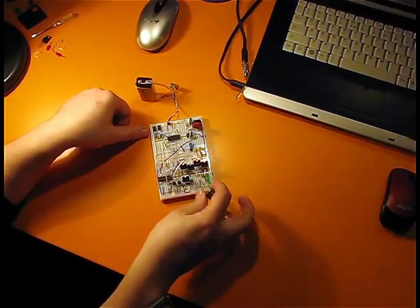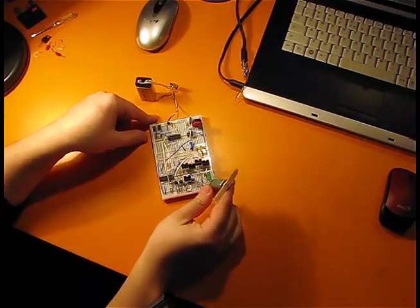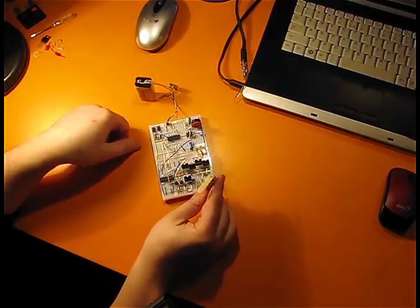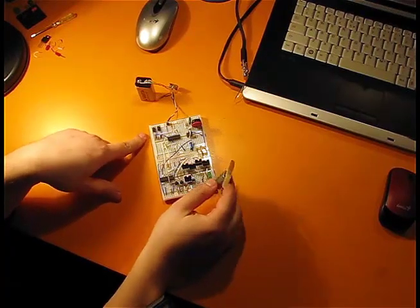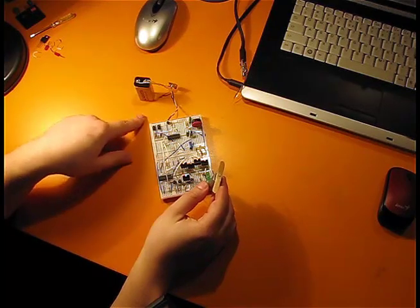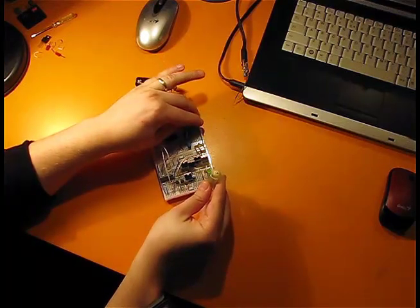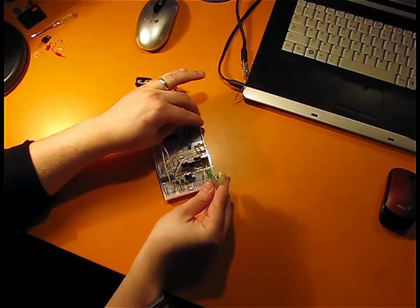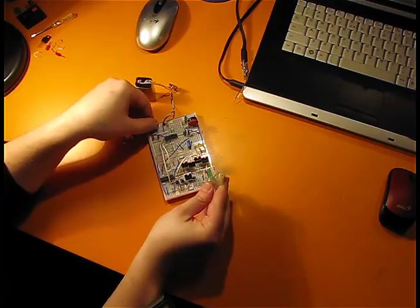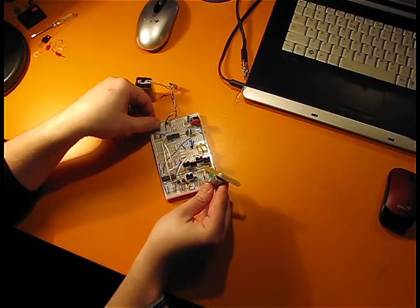What I have here is my motor in place. I know that many of you will say that I don't use a Schmitt trigger, but I don't have enough place for that. So I connected my switches to capacitors to the ground to get rid of the bounce effect. So I turn it on, spinning in this direction. I can vary its turning speed. So, okay, in the other way, one way, the other way.